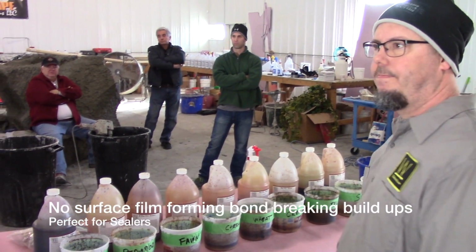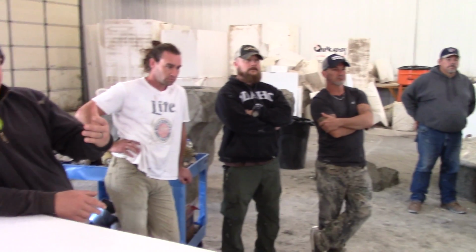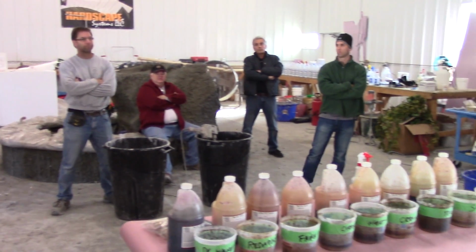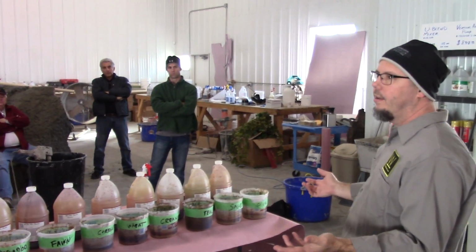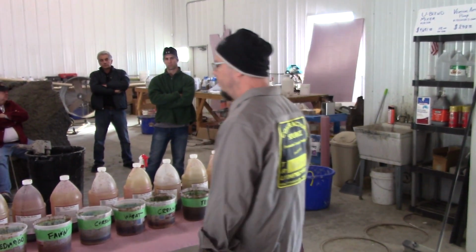Anything else? So you dump the bottle into the sprayer, and you're good to go. You don't have to dilute it or anything. But you can dilute it up to 1:1, 2:1. You can do 5:1 if you really want. Like dark walnut, full strength is really, really dark, which is great. A lot of times we're going to cut that at least 2:1 because we just want a real light chocolate brown instead. Otherwise, it's too dark. And any of them will do that.